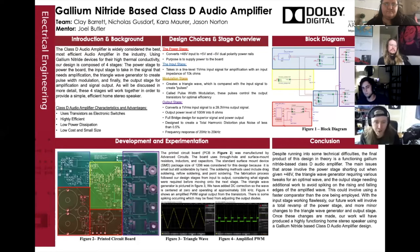After finishing each stage, experimentation will be done to ensure that each stage is properly activating. The group was able to center and establish a clear triangle wave from the generator, which is necessary for the triangle intercept scheme amplifier we had designed. After the triangle wave stage was properly generated, we moved on to the gate driver, which was responsible for creating the PWM signal required to drive the gallium nitride-based MOSFET.